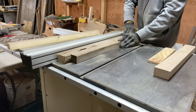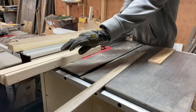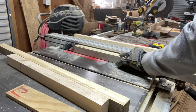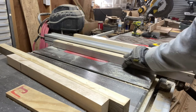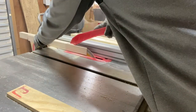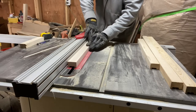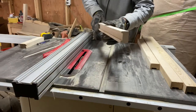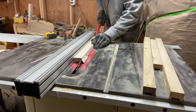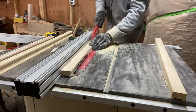This will give me three of the frame boards. For the fourth, I'll use a leftover scrap piece of 2x3 from the garage shelves I built this summer. The first thing I'll do is run them through the table saw to get them down to the thickness and width needed for the frame. Next, I'll run each board through multiple passes of the table saw, which is set at a quarter of an inch height. Finally, I'll remove a small section of face frame to create a layered look.